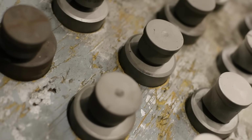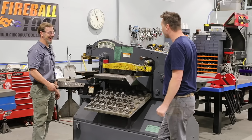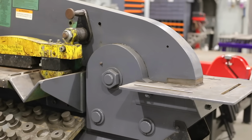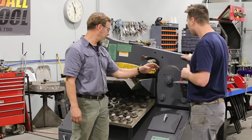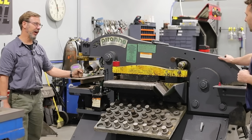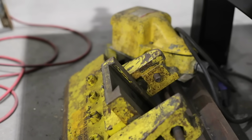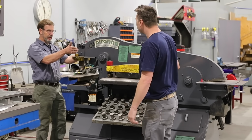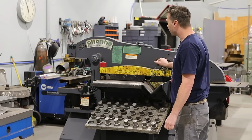But you have to have 3-phase for this, right? No, this is a 240 volt machine, 10 horsepower. So you could plug this into your welder outlet if you wanted to. It's pretty cool. Can we put it on my truck? We could try. So you got a nibbler here, we can cut angle iron here, we can cut flat bar, and then we come over here and punch. Yep, and then it also has bending dies and attachments. So it'll bend a 2-foot piece right inside this. Oh, so we can put bending dies here. Yep. Nice. And bend that way too. Yeah, it's a pretty slick machine.